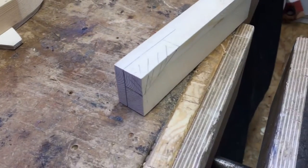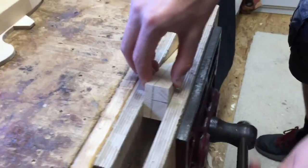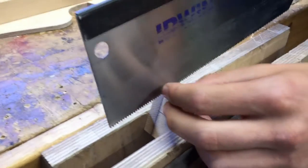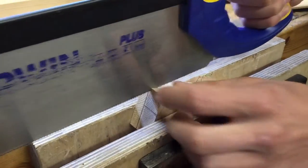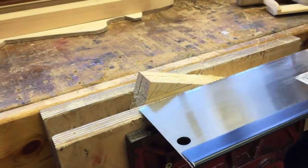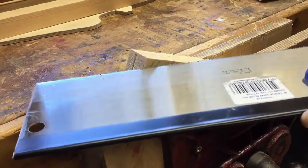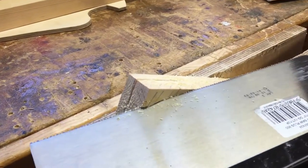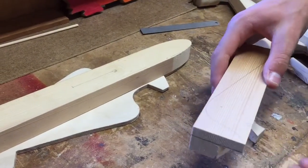There's your marking out there, so let's crack on with this. I'm going to clamp it in the vice — at an angle actually, so I can keep the saw level. We're cutting the intake hole first and then we're going to cut out the little wavy design. Now we can just go in from there. You may want to turn your work, but I've done it this way so you can see what we're doing. And then we're going to clean it up with a chisel later, but that's the main design.